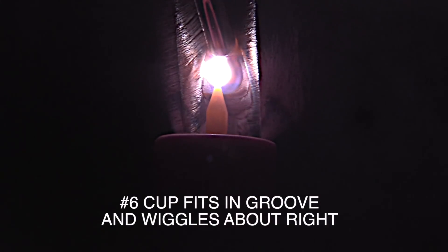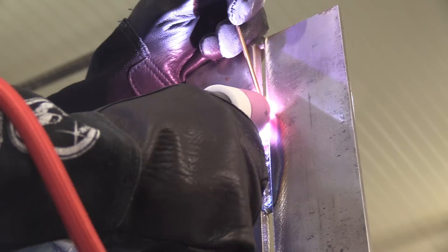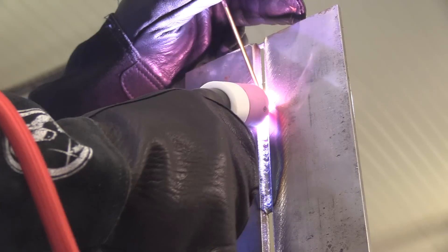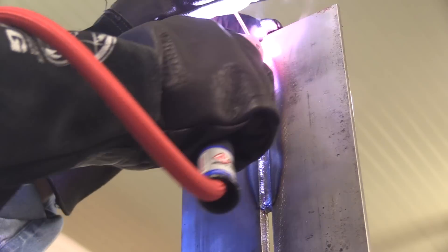Number six cup is working pretty good, my electrode extension is about right. I could have a little bit less and not be leaned back so far, but that's helping me film. The main thing I'm trying to do is not wiggle very far side to side — just a slight little wiggle to keep things moving. If you can wiggle only a little bit and hold a tight arc, it tends to punch the root in there, get a little bit of push through, a little reinforcement on the back side. This is somewhere between 96 and 100 amps and that seems about right — it hasn't tried to keyhole out on me and it looks like it's going in pretty good.